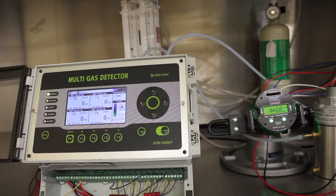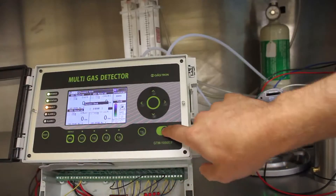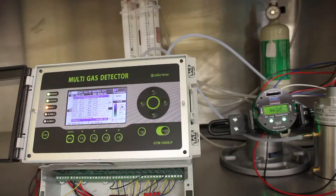Our sensor is reading about 50 ppm, and the Gastron unit still has not read anything. Going into the calibration menu, you can see they're actually reading about 42 ppm, but they seem to suppress everything below 5% of the maximum scale. These are 0–1000 units spanned with 500 ppm CH2F2, so 5% of 1000 is 50, and they don't show anything below 50 ppm.